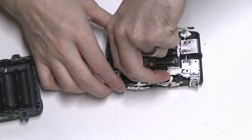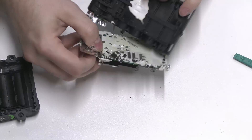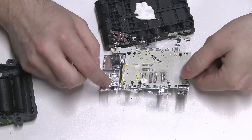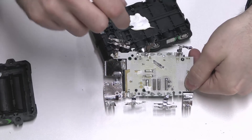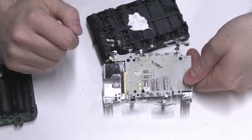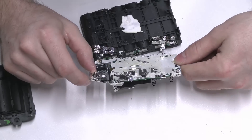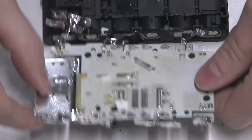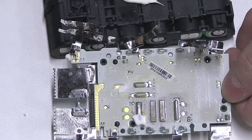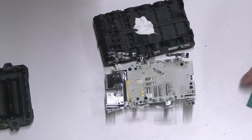If there was a chip underneath you would see the chip package — DIP packages are dual inline pins, a rectangular package; there's also a square-shaped package that I don't remember the name of off the top of my head. But I don't see anything suggesting there's really much in the way of smart chips on this board. So even though I can't get this side off, I don't think we're missing a whole lot.